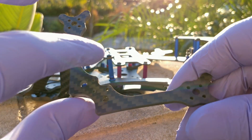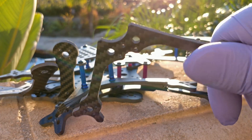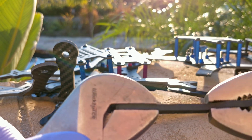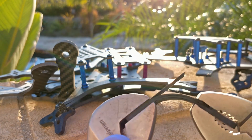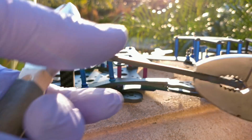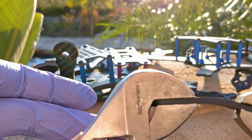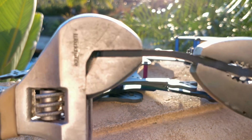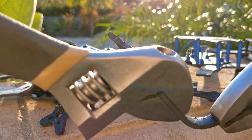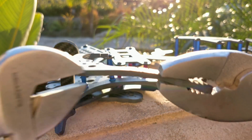Compare that to the arm that was properly cut with the carbon fibers going directly down the arm - it's exponentially stronger, it's not even beginning to be a comparison. Look at how hard that was to break. Now let's break the incorrectly cut arm - look, it's just bending with almost no force, the tool itself is bending it. It won't even break because it's so flexible due to all the resin. That is not what you want - it's just going to delaminate, crack, and break.